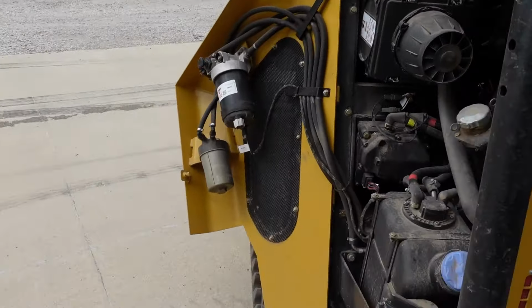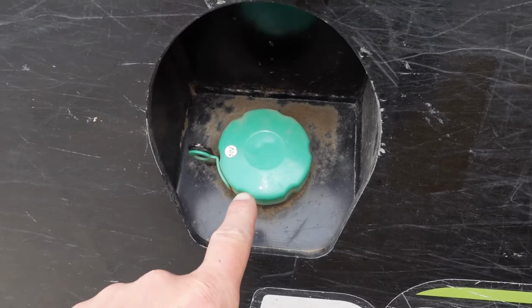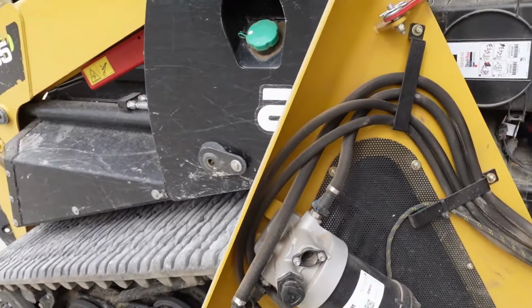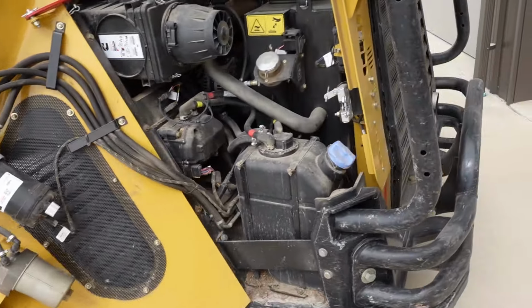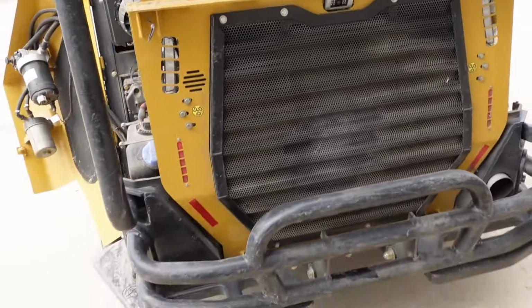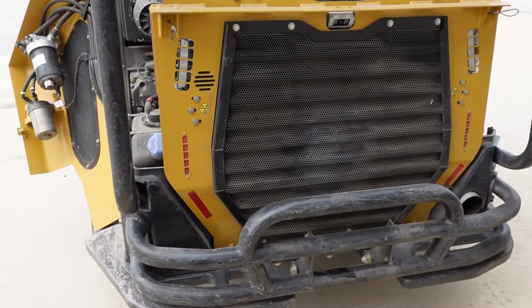The fuel filler neck issue has been resolved, I am happy to say. They swapped out the vent tube for a larger diameter, and now I can fill with my 25 gallon a minute 12 volt pump on all 3 full clicks. I've never tripped it, so that was huge.